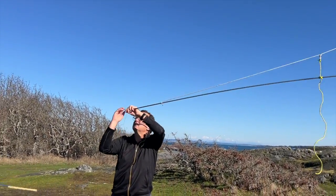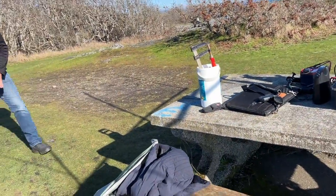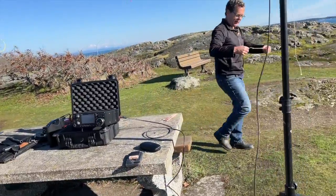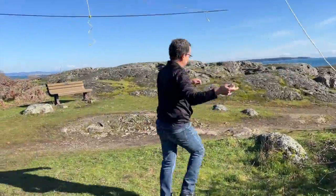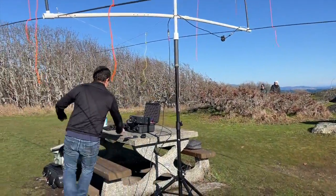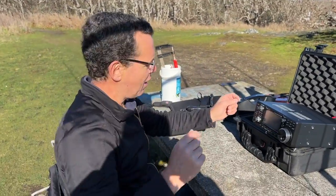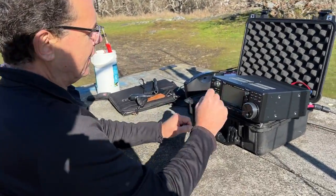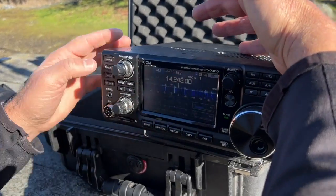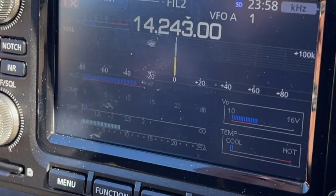Here we go. So in effect, for 20 meters, you're using a Moxon rectangle. Yes, I'm using a Moxon rectangle for 20 meters, exactly. And we should be resonant on 20 meters. Guys, I promise you this is not contrived. Doug, come and have a look at this. Can you see the screen there? Get the glare off it. There's the SWR there. Look at this. SWR 1.1 to 1.